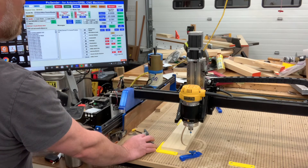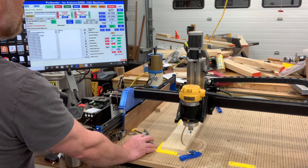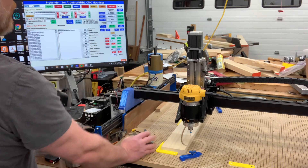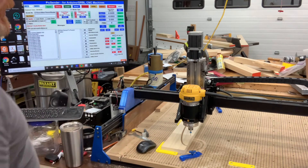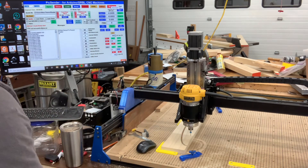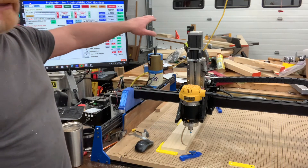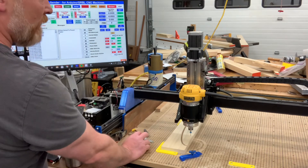I'll reset all those at some point. It's probably helpful to zero all these coordinates so you don't accidentally hit them. I'm not using any of these right now so I'm going to zero all of them out. That way if I accidentally do something and go to zero — negative 24 is somewhere off the table. Now they're all zeroed out, but you can write down 'G54 is my flag setting' and 'G56 is something else.'